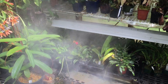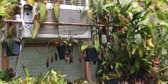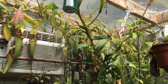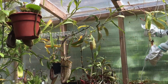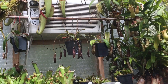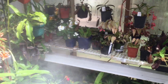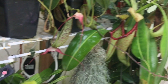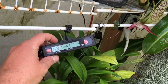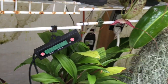When it's not really hot, the air conditioner triggers the humidity system and it goes on for about one minute, then off again for about 10 minutes until the air conditioner brings relative humidity back down a few points. The great thing is it's completely sealed in here — very, very humid — and I can feel the cold air coming out so it's working properly. Once the air conditioner turns off, the humidity will soon catch up. On a hot day, 88% humidity with the air conditioner running is not bad at all.